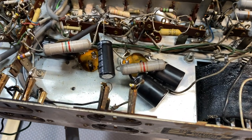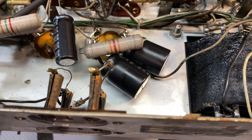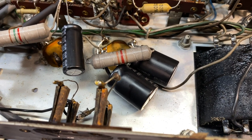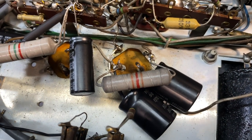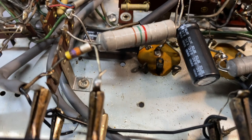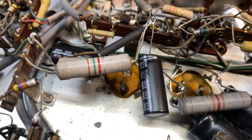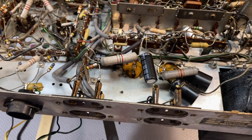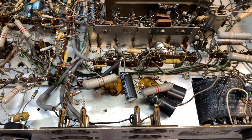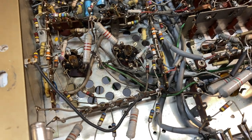I decided to put these on the underside because there is so much space. Now, those two over there are the first two filter caps. These are 450 volt caps, 47 microfarads each, to replace the dual can that was in there. And I've removed the contact so that the old capacitor is completely removed. And here is one on the underside there, and one that goes to a tag point, which was connected to the capacitor anyway. So the four filter caps, this thing uses four 50 microfarad filter caps. Those have all been replaced. And other than that, I have seen no capacitors that need changing.